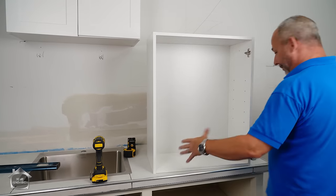If all my cabinets are out of alignment, okay, but all the knobs are level, the knobs scream. And if they're like this across your kitchen, even if they're in the perfect position, it looks stupid. So you got to decide for yourself, is my kitchen installed level and plumb enough that I can put the screw in the same spot, or do I got to make sure I drop a laser line and put all my knobs in the same spot? It's not a simple question to answer.